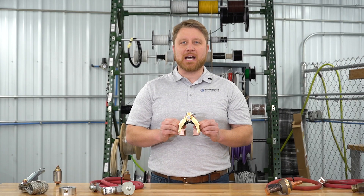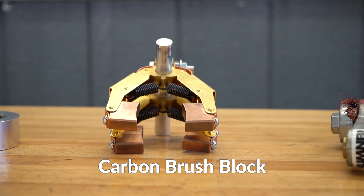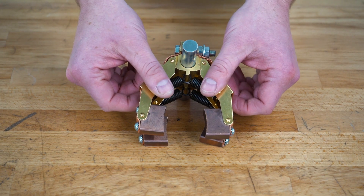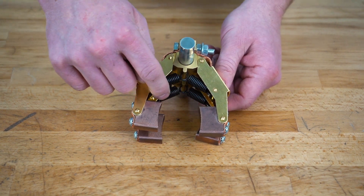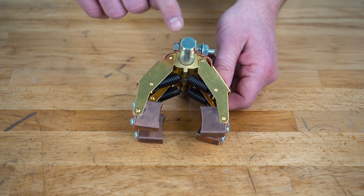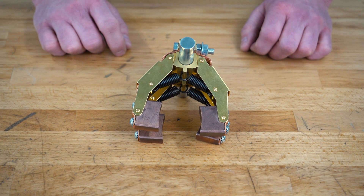The next option that is relatively common is using carbon impregnated brass brush blocks. The spring-loaded brush blocks slide on the outer surface of a rotating shaft and current is transferred through the brush blocks to a stationary ground cable attached to them. This is really similar to how a brush slip ring or a commutator block might function.